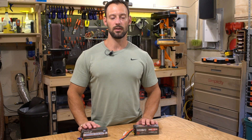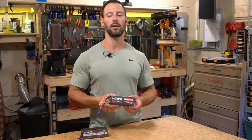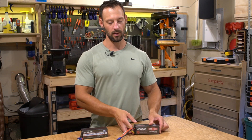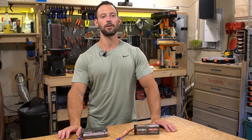The thing that stands out most is the capacity. The HuVu only discharged 4,000 milliamps down to 3.6 volts — a voltage I consider unusable. I thought it was borderline criminal: how can a company sell a battery advertised at 6,200 milliamps yet only deliver about 63% of that? The answer is: not all batteries are created equal. I also saw one manufacturer recommend discharging down to 3.2 volts, which I strongly disagree with from my LiPo experience.